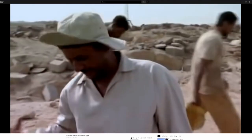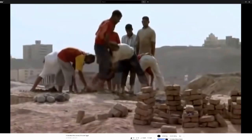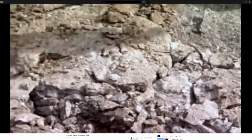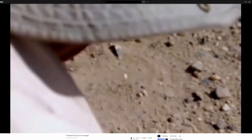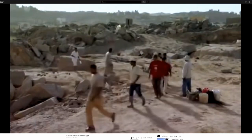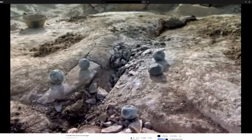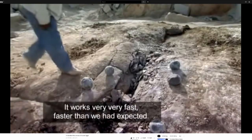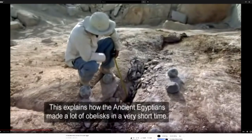It's very hot, but what damage has the heat done? Adel can now experiment whether fire-weakened stone is easier to split than an untreated fracture. After half an hour, he calls stop. Without fire, the workmen on the control test have made little impact on the fracture line. But at the burnt fracture, the crack is crumbling. You can see how fire setting affected the granite layers. It's working very very fast — more than what they expected.